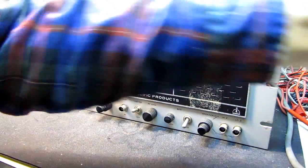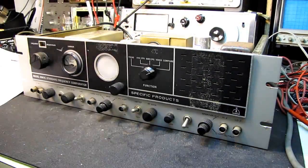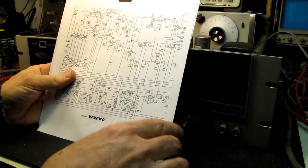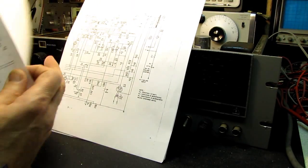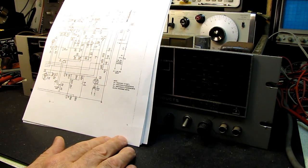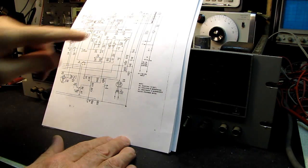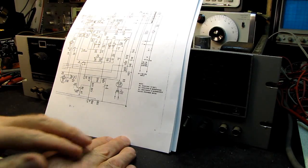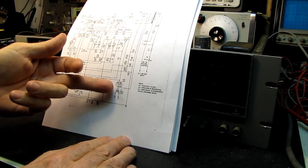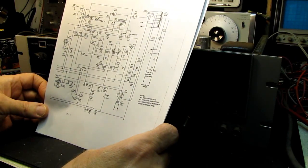There's also something else suspicious I've been trying to track down. The schematic I have is for an older version using vacuum tube rectifiers; however, most of the schematic seems to match this receiver. The resistor dropping network is identical. The major difference is that instead of a 5Y3 there are solid-state rectifiers, and instead of a 6X4 there are solid-state rectifiers — other than that the schematic is pretty close.